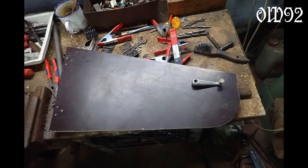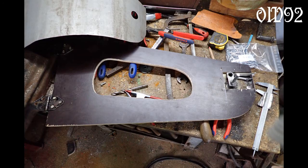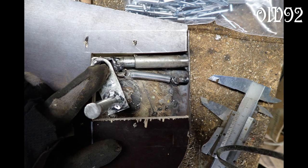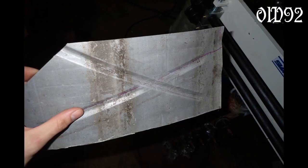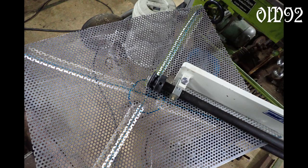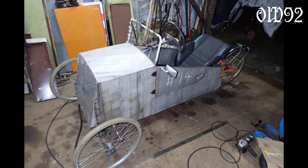Here I am building a door with a wooden plate as a frame and a piece of aluminum sheet as covering. I even constructed my own door lock. I wanted to make the front grill out of aluminum hole sheet, but just the sheet metal wasn't rigid enough — it was wobbling a lot — so I decided to strengthen it with beads. Therefore I needed a throat bead roller machine. I spent some money and bought a cheap one.